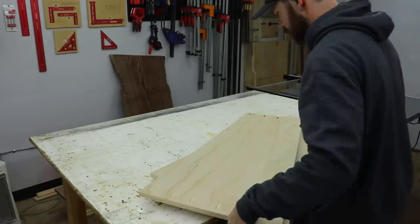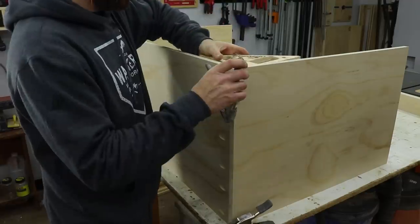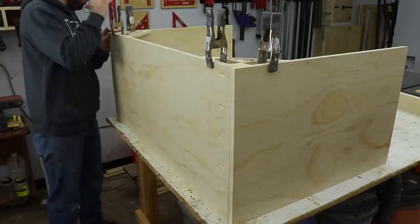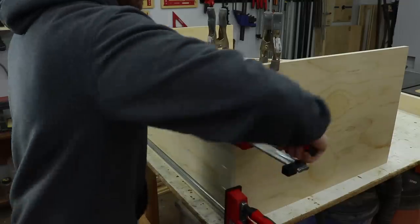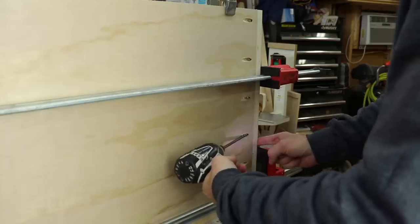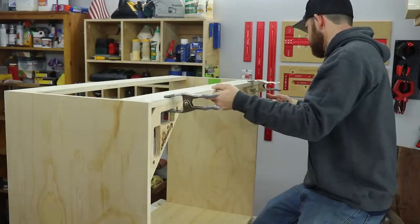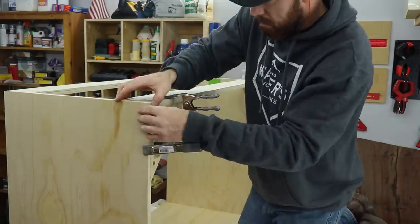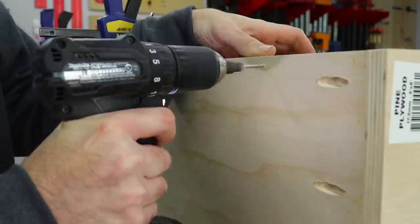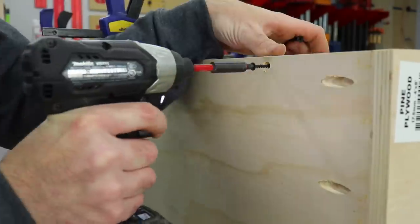Back at home I can get all the pieces out in order and start assembling the cabinets. These clamp-on corner squares from FastCap are something Oscar actually designed himself — they're called Oscar Squares. You just use spring clamps and clamp them in the corners and it squares everything up while you get your other clamps on. I used around 600 pocket screws on this project — it was just the cheapest easiest way to do joinery, and for cabinetry it's actually pretty popular. These are the nailers that attach the cabinets together; I also put some regular screws up through the bottom and through the top with a countersink bit to make sure everything was secure.